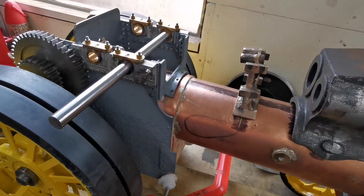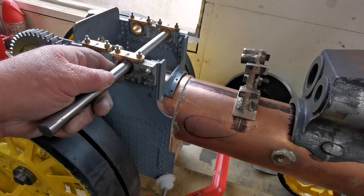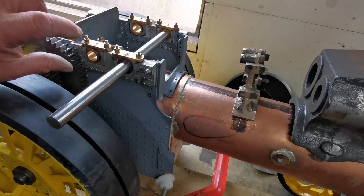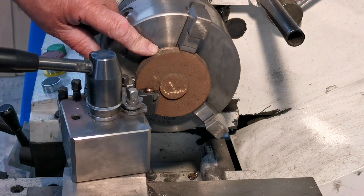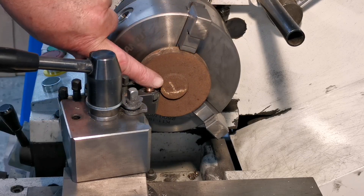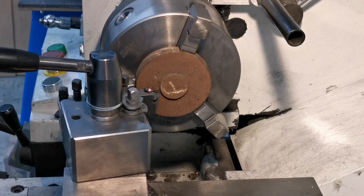The next thing I'm going to do now — I have got the material for my blind bushes, but as I've made the second shaft and turned the metal down for the second shaft to go in there, I'm going to start machining up the gears for it now. This is the first gear I'm doing. I'm going to face the centre off, and then this face here needs to be one eighth lower than there. Then I'll bore through to fit onto the shaft.